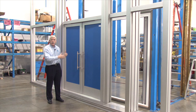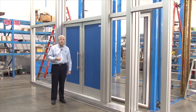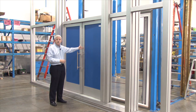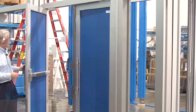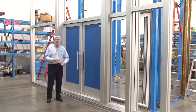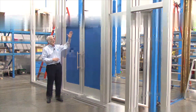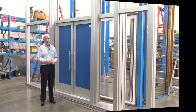You can have a fixed panel next to it, or you could have two sets of double doors, and you can even have another set of double doors on each end if that's the way you want the door set up. The side fixed panels have to be the same width as the movable panels. These doors will function once in place like a standard opening door using standard 36 inch wide doors. This can be glazed with quarter inch or one inch insulating panels, or you could put other types of glazing panels in the system if you don't want to use glass.